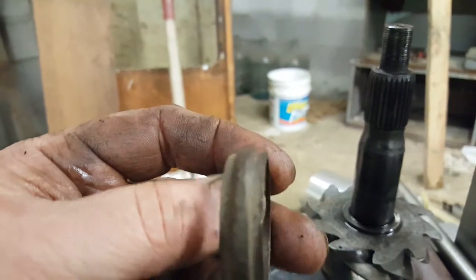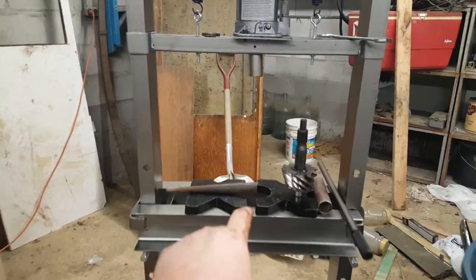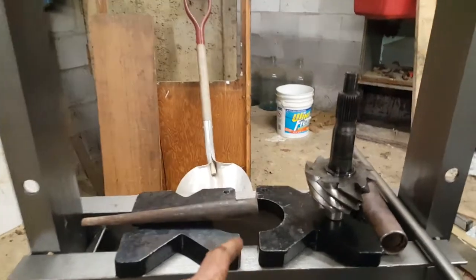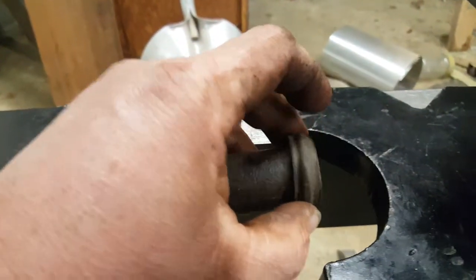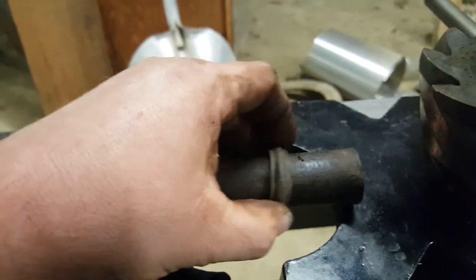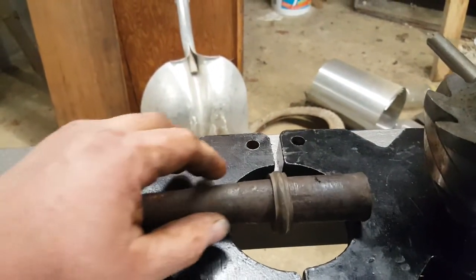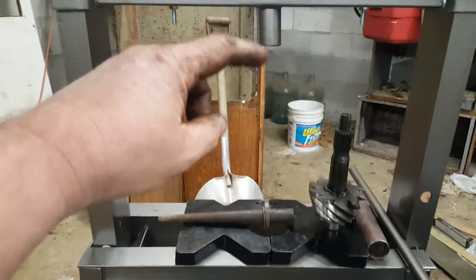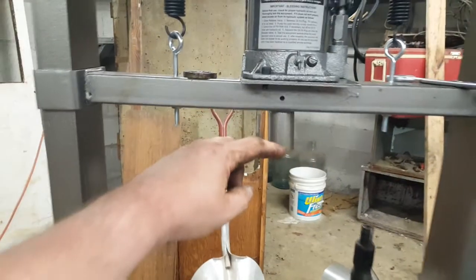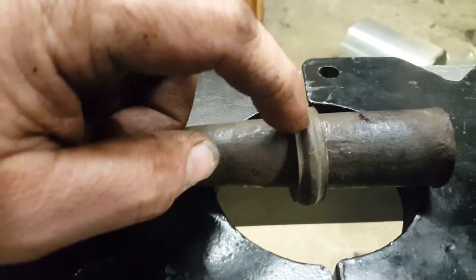I had one that was already crushed down. What I did was put it in my press, and I got some metal support pieces and found a round drift pin about an inch and a quarter in size — so I can lay it on there bridging the gap. Then bring the press down and let this push pin push down on that and flatten it out just slightly.